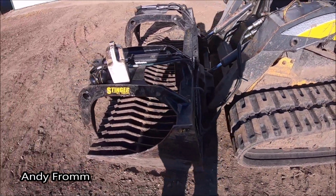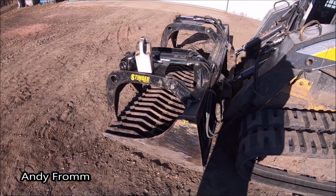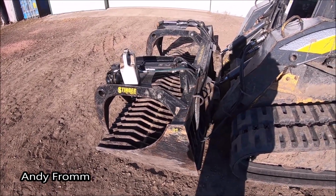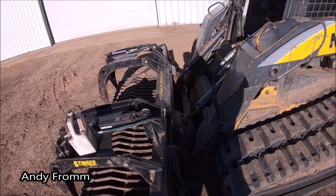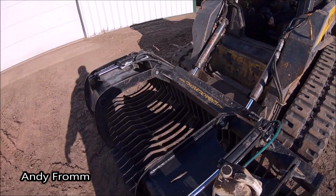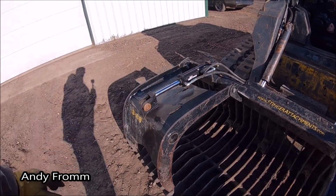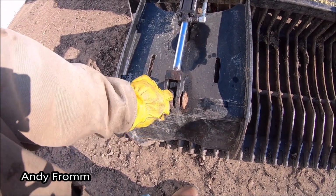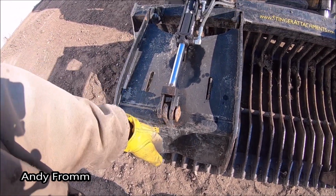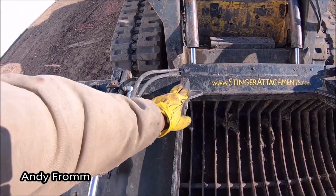not sponsored anyway, but it is an 88 inch Stinger attachment rock grapple bucket. I believe they're somewhere by Rochester, Minnesota. I haven't been able to break this one yet. A couple things I don't like about it though. There's no bushings in here. It's just metal on metal, mild steel, not greasable. Cylinders seem a little bit too small.